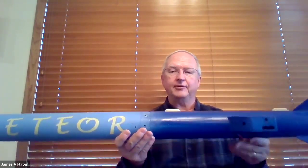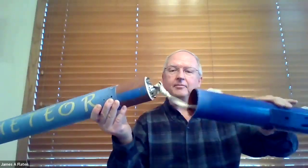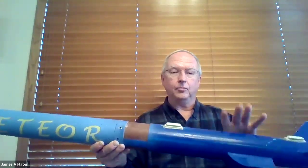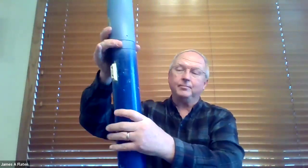So how do I accomplish this? I have three options. One of the options is called a friction fit. I want a friction fit for the lowest separation point. I want to make sure that the bottom of the rocket can come off relatively easily at apogee when the motor eject goes off, or perhaps I will put into my avionics bay a drogue ejection charge. I want either of those to be able to drive off the bottom of the rocket relatively easily. Friction fit basically means if I hold the rocket vertically above that point, I don't want this part to fall off, but I do want it to be able to come off if I were to shake it or pull on it, but not twist on it. Explosions never twist.